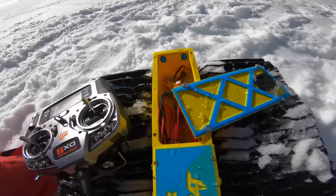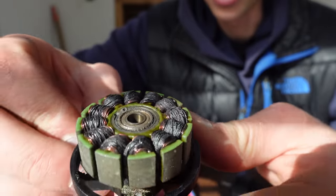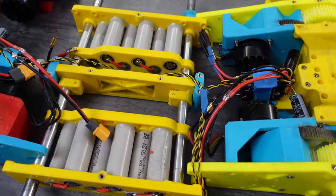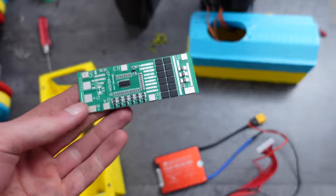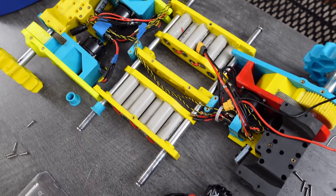We got smoke coming out of here. Not sure what burned out, but something's not happy. So roasted. The other three motors look fine, so I'm going to switch back to six-cell before I burn those out too. I'm going to replace this BMS with a six-cell BMS, and then rewire all these cells to be 6S2P instead of 12S1P.